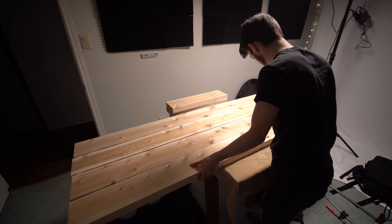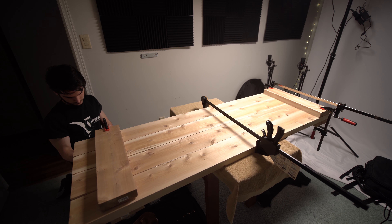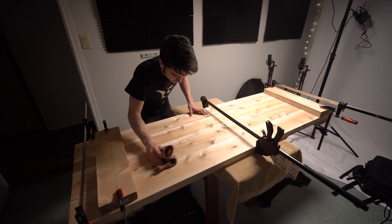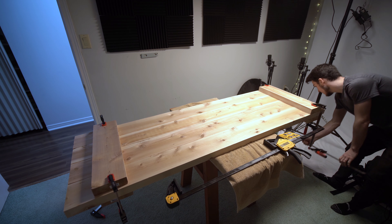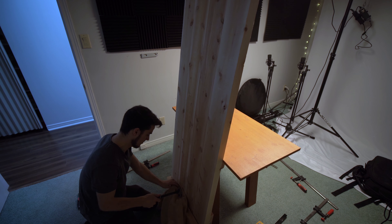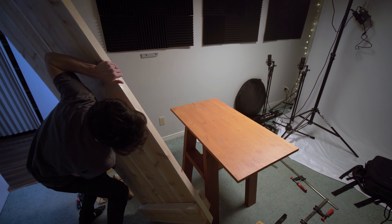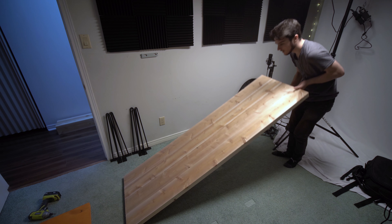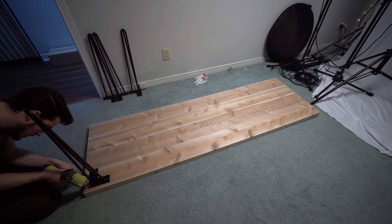Fourth, we're going to glue and clamp all of our edges together. For this you're going to need wood glue, six small clamps for the culls, and six culls each the width of your table so you can flatten the edges. Cover one side of each cull with packing tape — the side touching the table — so the glue doesn't stick when you remove them. I didn't do this when I built my desk and regretted it because I had to knock them off with a hammer, which could damage your tabletop. You're also going to need three large clamps for bringing the edges together.